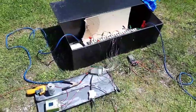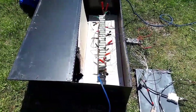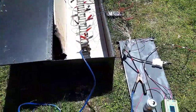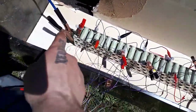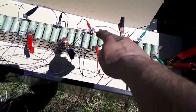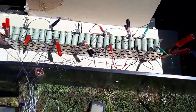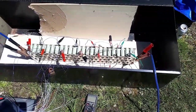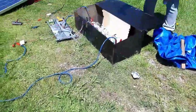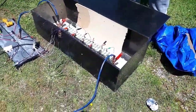Alright guys, we're going to try and blow up this pack today. I've been charging and discharging a little bit - it's sitting at around 40 volts. One of the cells was at like 1.1 volts - one group, which was one of the ends, probably this end here. Cell 8 is between here - these are the ones that are going to blow when they blow. Right now they're sitting at 3.58 volts and the rest of the pack is at 3.2 or so. The BMS can only balance at 60 milliamps - that's all that's going through these middle wires, 60 milliamps. The little wires are not going to even get touched.